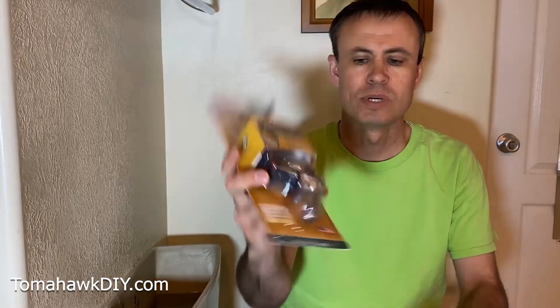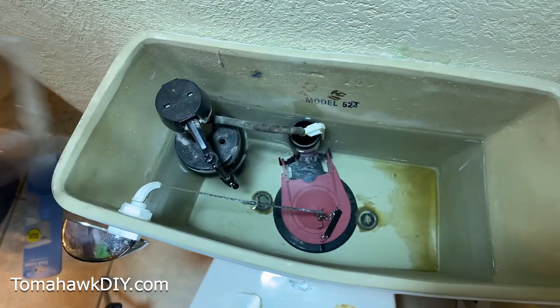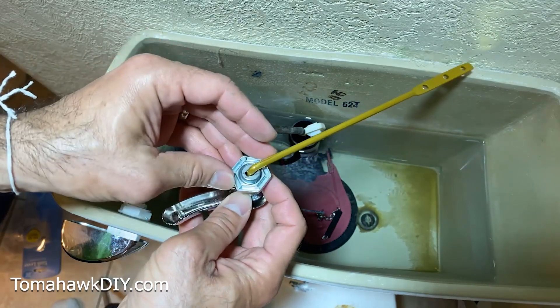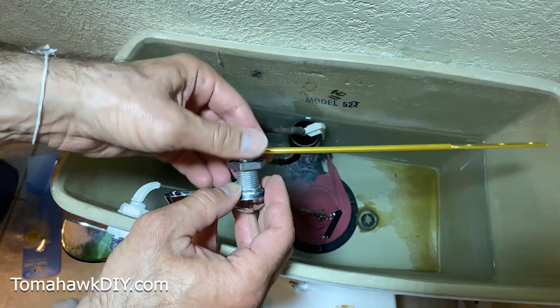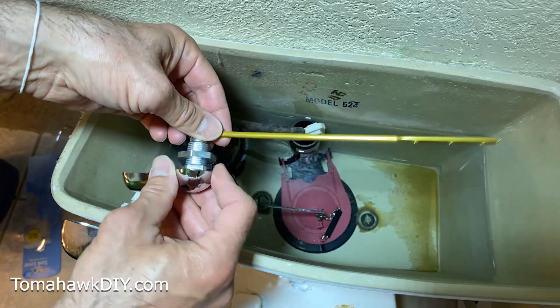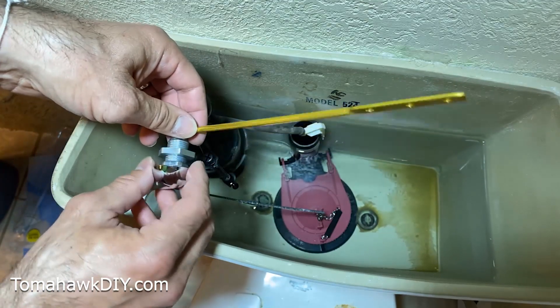There are also more expensive ones with fancier looking handles. Those still have plastic, but they claim to guarantee them for five years with a longer warranty. Here's our new lever arm. One thing to be aware of — a little trick with these: they screw in reverse thread. Righty-tighty doesn't work here. The way you might expect it to screw on isn't going to work. Having it screw in reverse thread is just to keep the lever handle from coming loose over time as you turn the handle.